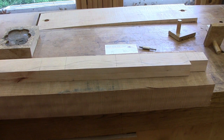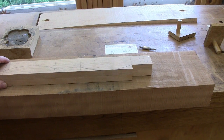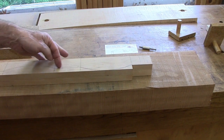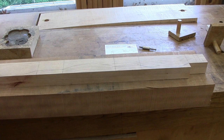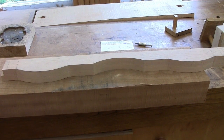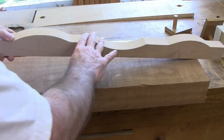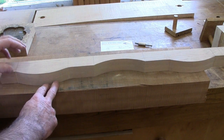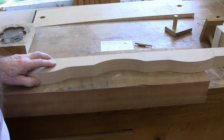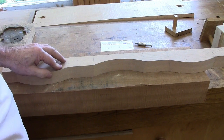I cut the corners out with the table saw to get a nice straight edge, and now the curves have to be cut on the bandsaw. I'll leave a little extra material so I can clean it up when done. I've bandsawn out the two drawer blades — they're still tacked together — and I'm cleaning them up with a spindle sander. The sharp corners have to be cleaned up with a chisel, and then the two drawer blades should be in good shape. I'll use this as a template for the apron.